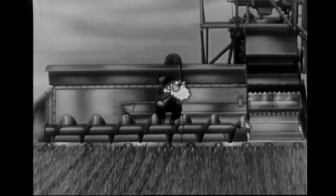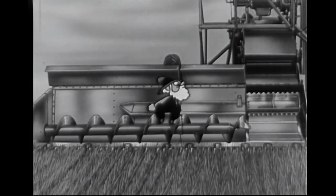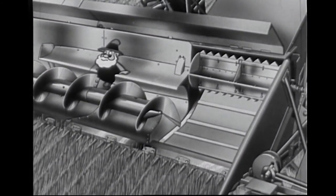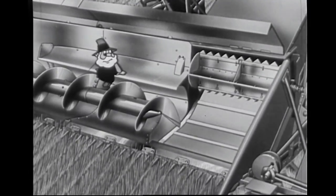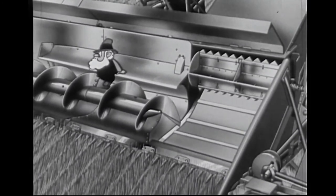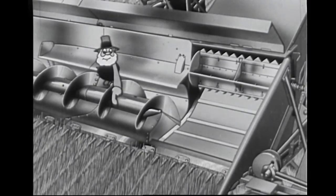See that platform auger? That's an open-end auger, turning on heavy-duty, precision-type roller bearings at the outer end. An adjustment allows the auger to be angled up or down toward the inner end according to requirements, so this auger can be set to handle a light crop or a heavy crop with the same efficiency. Another feature is that you can fold the platform and auger up against the side of the machine when passing through gates or moving on the road.